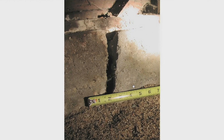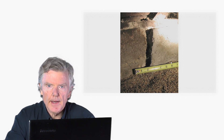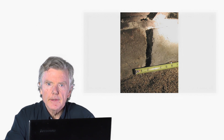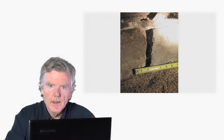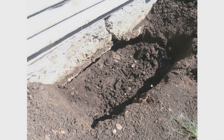Now let's go into foundation cracks. This is a fairly large crack. Cracked foundations are fairly common in the Bay Area because the soil here is expansive clay soil — when it becomes wet it expands, and when it becomes dry it retracts, and that movement causes cracks. This is something that can be addressed if you wish, and personally I don't think it's a big issue — you can retrofit without addressing the cracks — but here is one of the repairs you might want to follow.